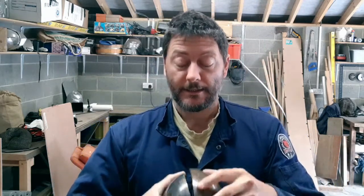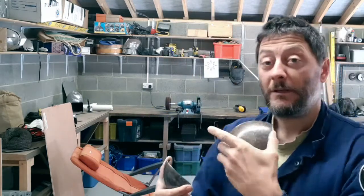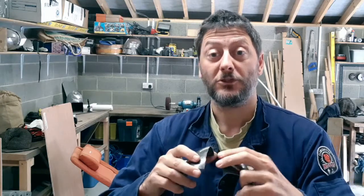As this steel is hot rolled, it's got an oxidized coating on it, so I'm just going to go to the bench grinder behind me first and just use the polishing side of it to trim off the oxidized material on both sides to allow it to weld easier.